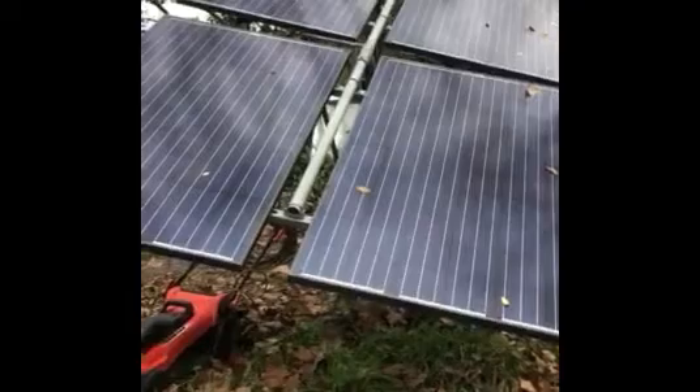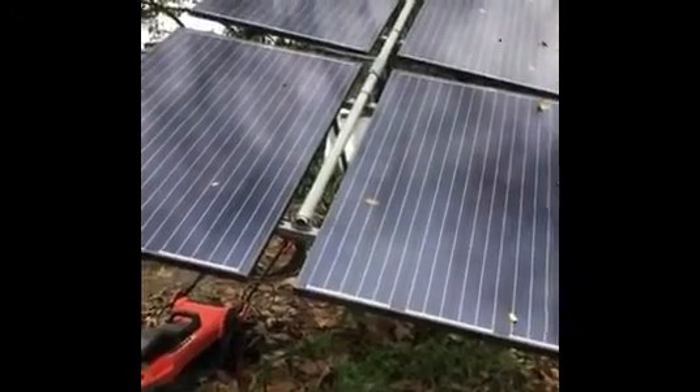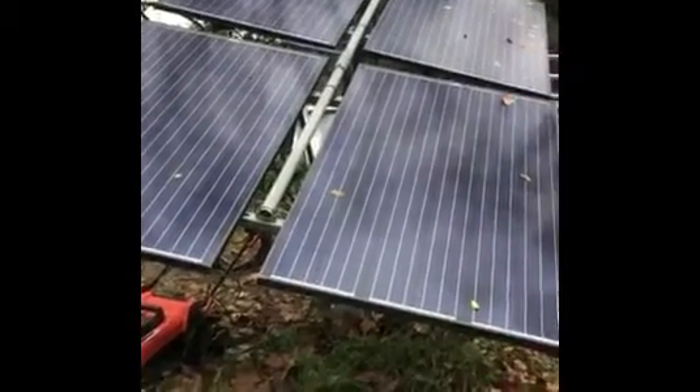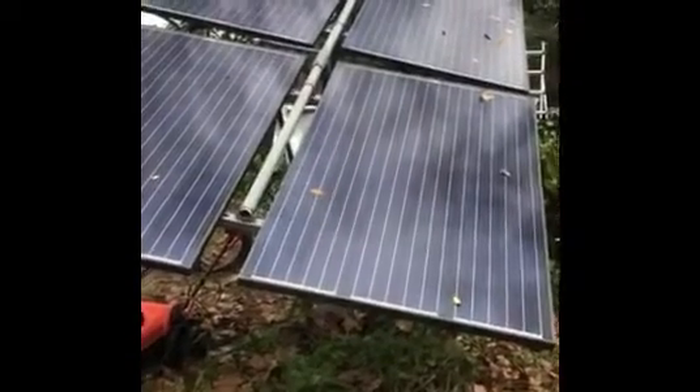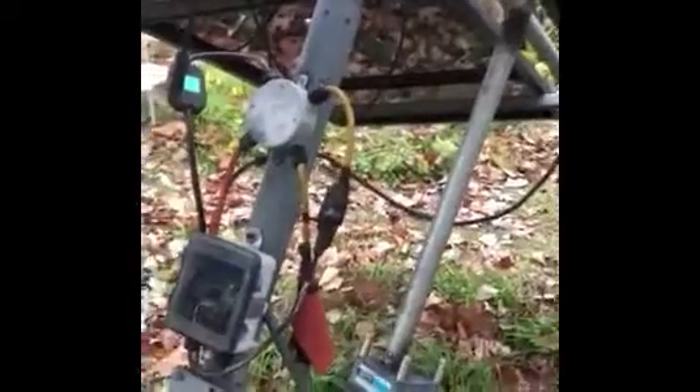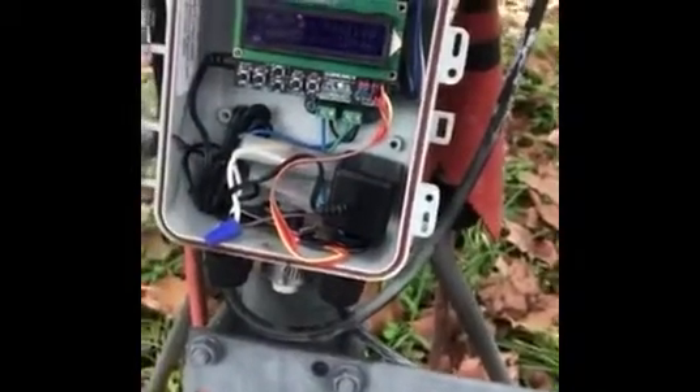This is the third tracker — a single-axis tracker that I want to briefly mention. It could be up to 1,200 watts, though panels are bigger than 300 watts today, so it depends on the size of the inverter you can match to it. This bar is the rotation axis right here, and there's the actuator with a torque arm. This is one of those gearhead motors with a resistor and capacitor in it, and the control box houses the Arduino Uno, a display, a solid-state switch, and a real-time clock.